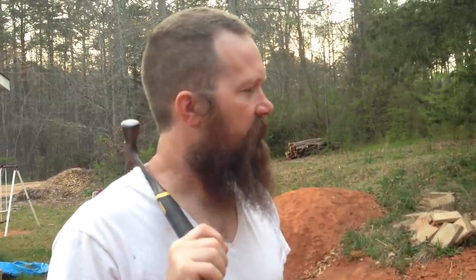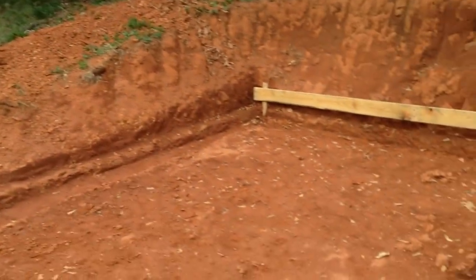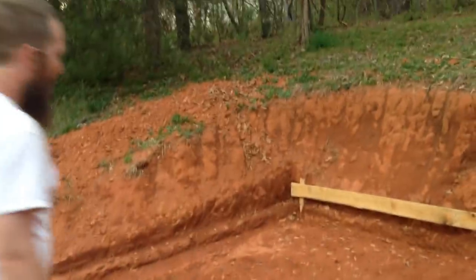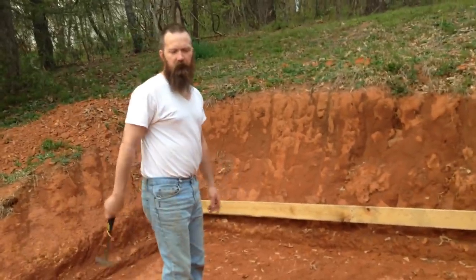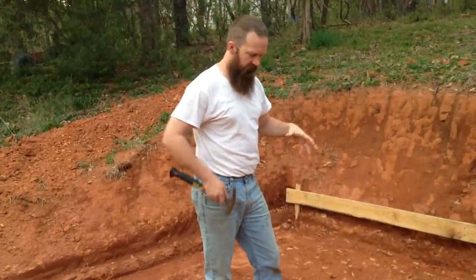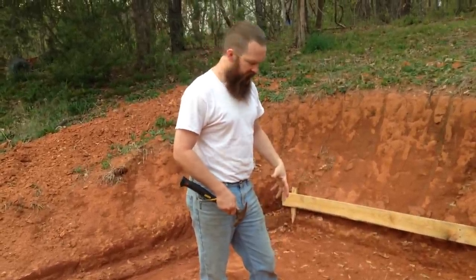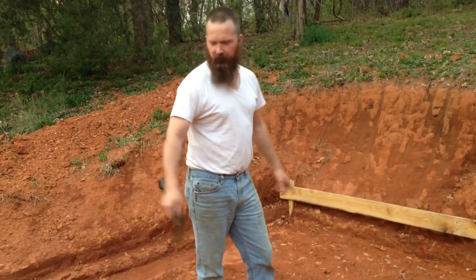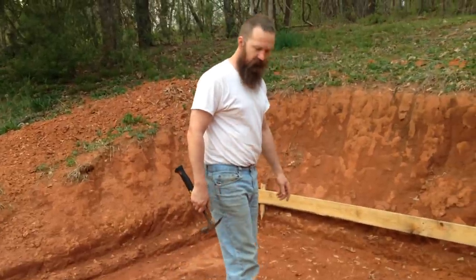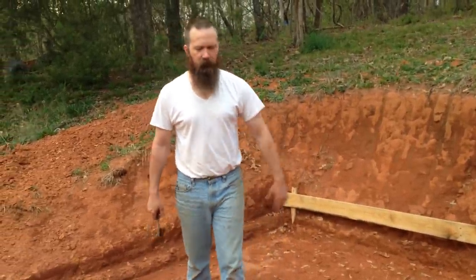I'm making this too complicated - we are going to uncomplicate this. That form I just put in is going to come out and come up front to be the form across the front, then I'll form in these sides. I've also got to dig a hole right here in the middle for a footer, because it's going to be load-bearing - I'm going to put a post right here to hold up the ceiling. Once it's reasonably square, I'll find close to the exact center and dig out a 16 by 16 inch hole about four inches deep.